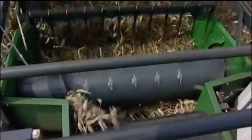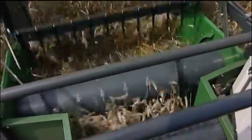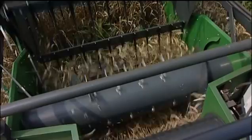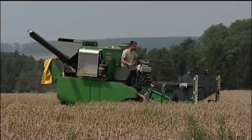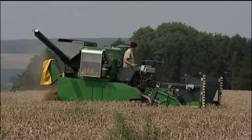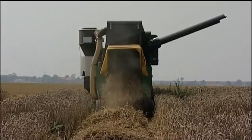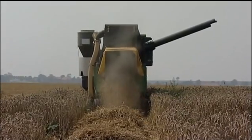An important component is the cutting platform with conveyor belt, and optional mechanical rape knives work well in combination with the auger and an additional feeding drum. Even in heavy crops, this cutting platform provides a smooth and even crop flow into the threshing unit. A universal concave is used which is suited for all crops and provides an outstanding threshing performance.